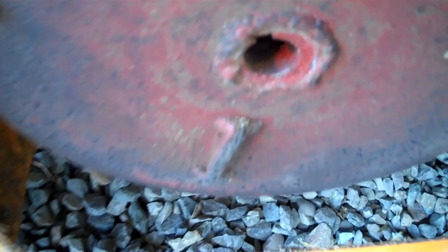That's what the inside looks like. Here's the wheel from the outside, and on the inside there are three bolts right there that keep it from turning. So you have the keyway in there that keeps it from turning, and then you've got the three bolts on there that keep it from turning. We're going to undo those three bolts right now.